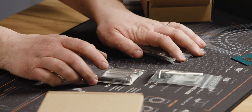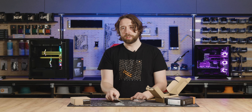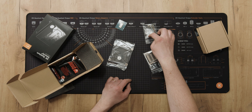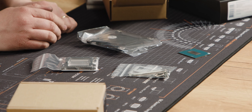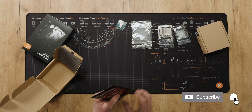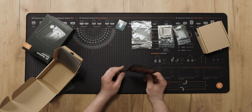This goes onto the motherboard and holds the CPU in place, and this gets installed onto the block which you are upgrading. You can upgrade any Velocity 2 or Momentum 2 to use this. There are two different protections inside — one for 12th gen chips and one for 13th gen chips — and all of the screws you need to put everything together. You also have, in all of the direct die products, Thermal Grizzly Conductonaut, which is the appropriate paste to use for the dies themselves.